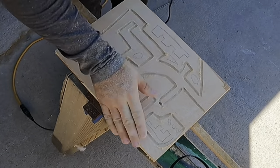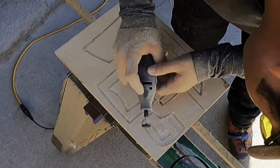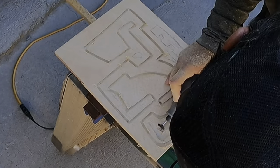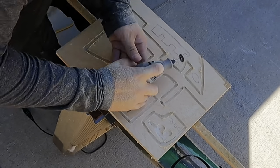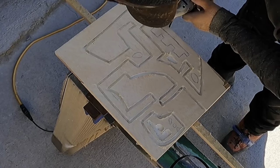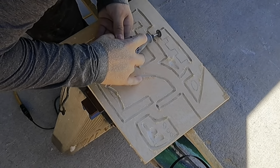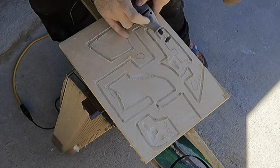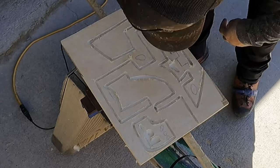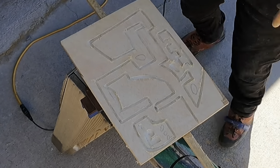There are a few things to know about them for maintenance that we can talk about in the future. Here I'm running the Dremel on about speed level 8 and it's doing pretty good. The birch panels are amazing because, like I said, they're flat. Since they're considered a finished panel that you either put veneers on or stain or paint, they typically have really good seams on the birch side. Where things do joint up, it's not nearly as much of an issue, and they don't tend to gap out, chip out, or flake out. They don't create issues for creating a wood-carved panel for either display or for inking for woodblock printing.